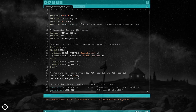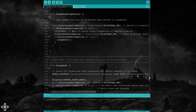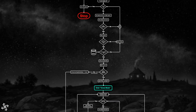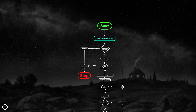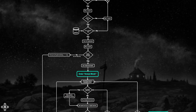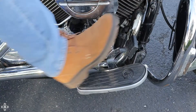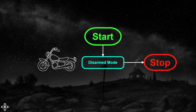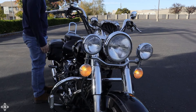Before we start looking at the code, there is one thing we need to go through first. The majority of the code was based on a flowchart which really helped break down complexity — this flowchart is almost like a blueprint, and it's critical that you comprehend it. Most of it is written in plain English so it's quite easy to read. Let's review the flowchart to understand the working principles of the system. The most important thing to keep in mind is that it's all divided into what we are going to call modes. The first mode is the disarm mode — this is the state the system goes through first, happening when the motorcycle is completely off and we turn on the system momentarily to scan tags by pressing down on the brake pedal. If a valid tag is not scanned, the system will turn off.